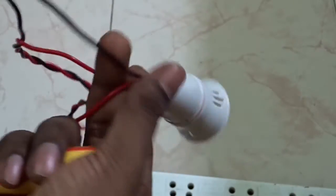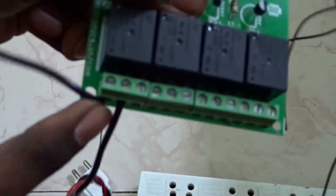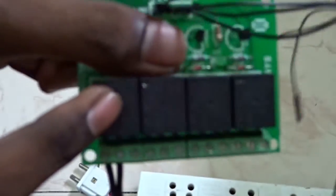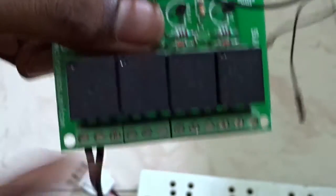You can see here I have connected my bulb holder to the relay. Please make sure that you should not connect a different wire to the relay pin — you have to cut the same wire and connect it to the relay, because this is going to act as a switch. It will connect these two wires, so the cut wire will be connected when the relay is activated.